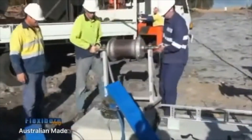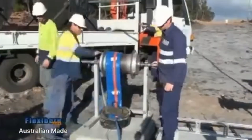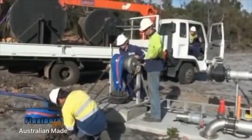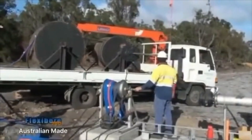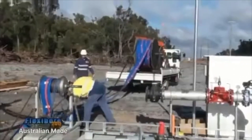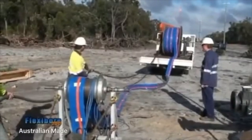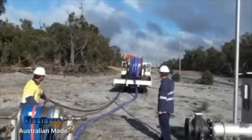The pump is lowered and comes to rest inside the casing, firmly suspended from the clamp. The roller is placed into position and safely secured to the ground. The crew is now ready to unroll the flexibore and the power cable. Note on the right hand side of the vehicle the low level probe cable as well as the motor temperature cable being unwound.